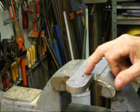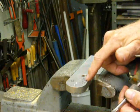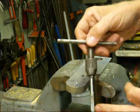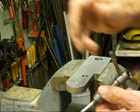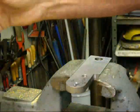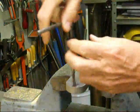Now we've got a piece of cast aluminum, and I've already drilled a couple of holes in there. They're 13/64ths holes, and I'm using a T-handle tap wrench with a quarter-20 high-speed hand tap. That's four flutes. Make sure you do not use the Mystic Metal Mover on aluminum — it causes a chemical reaction. You want to use aluminum fluid, or kerosene, or even regular oil, which works fairly well.